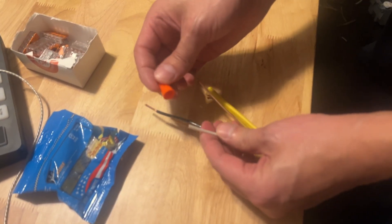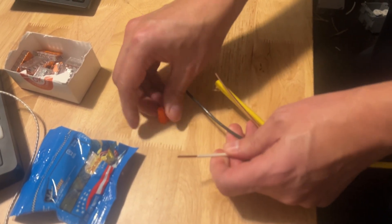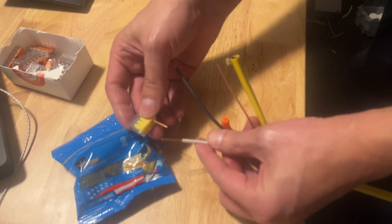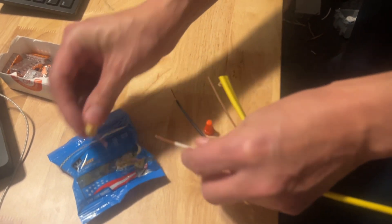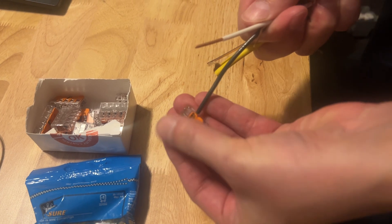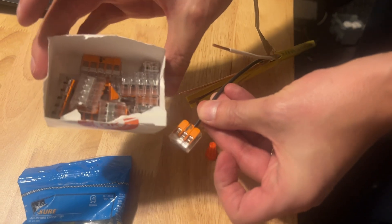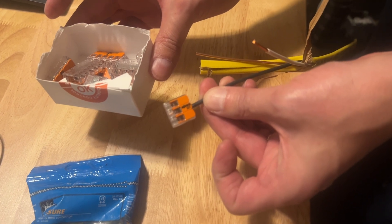Incorrectly using electrical caps. Some homeowners will mix and match wires and won't get a good snug fit on the electrical caps. There are newer options excellent for do-it-yourselfers: push connectors where you literally just push the wire in and it forms a tight bond, or updated lever lock WAGO connectors — you simply open the levers, insert your wire, clamp it down and it is tight, then connect to your next wire.